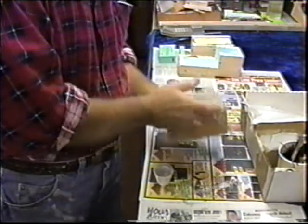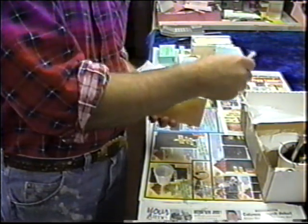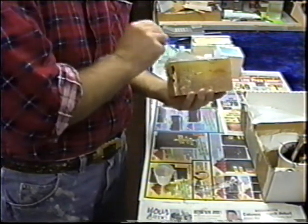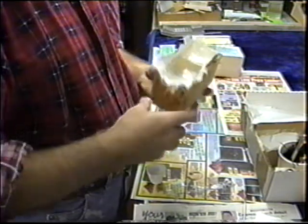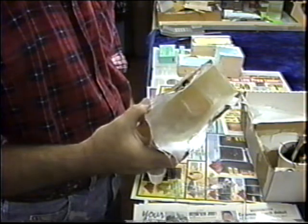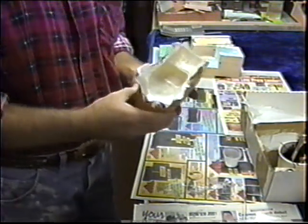And today, what I found to be a tremendous help here is, in the past, what I've done is take one of these rubber molds at a time, make a part, clean up, put all the stuff away. Then the next day, somebody'd order another Cardinal cowling or whatever, and I'd tool up and make another one. What I've done the past two or three times, and it's worked out real well, I figured I'd put this on the tapes. I've laid out all the molds, got everything ready, got all the cloth ready, and got them all done in the same setting.